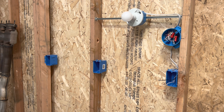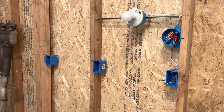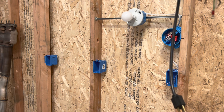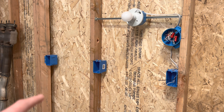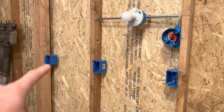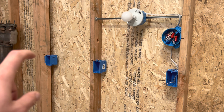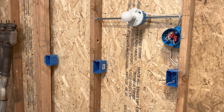I'm going to go ahead and show you this. I'm going to put a little power wire out of here. I have this old piece of wire right here — I'm just going to cut the end off and use this as my power plug-in. So I will run a 14-2 out of here and then tie in that little whip right there for power. I'll have the 14-2 in the box, and then 14-3 between this box and this box, and 14-3 between this box and the next box.